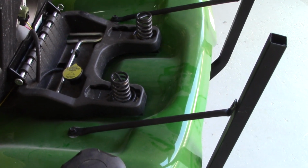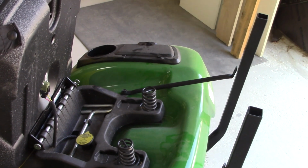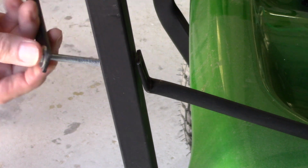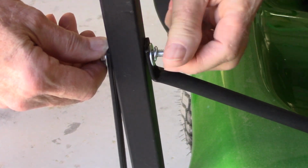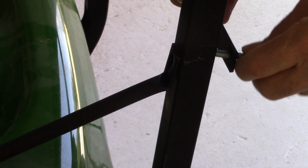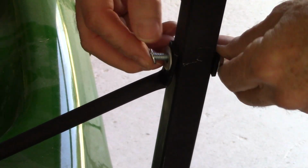Here's a look at how the receivers and braces should line up at this point. Next, the instructions call for attaching the cross brace to the receivers and side braces using the 1.5 inch, 1/4 inch diameter bolts. I decided to add a flat washer and lock washer to each of these connections, which required 2-inch bolts instead of those in the kit.